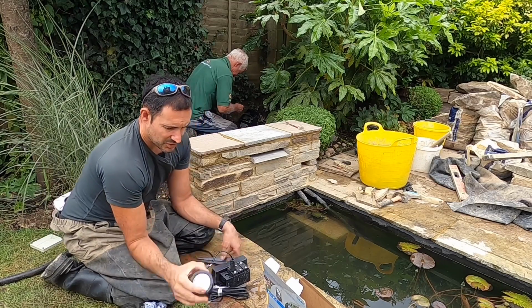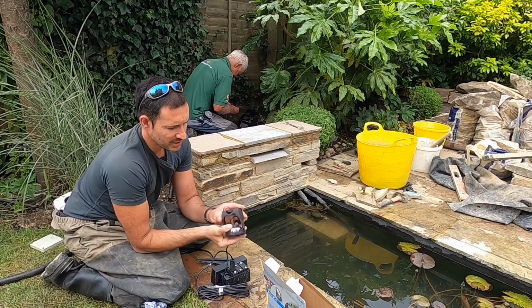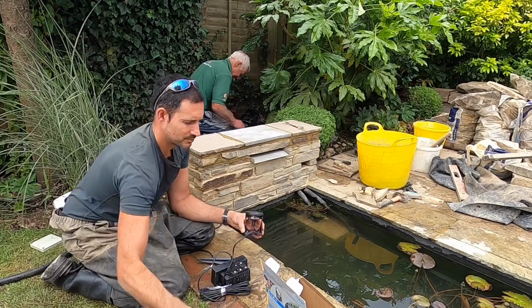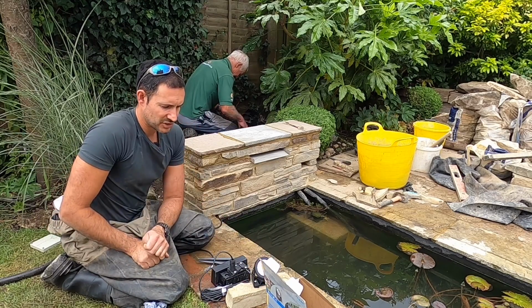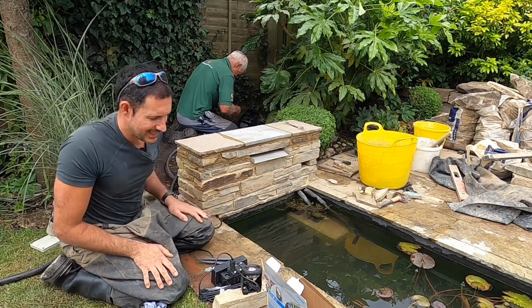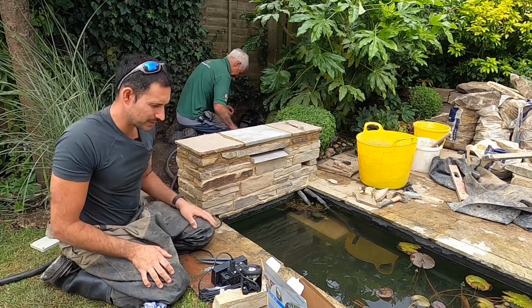But I think I'm going to remove, you've got a couple of stainless steel Allen screws on here as well at the base, and then you could actually screw that directly to something. So if I screw and rawl plug that to a heavy stone like that, which is going to act as a nice anchor, I can position that exactly where I want to, I can angle the light exactly how I want, and that will illuminate and uplight that quite nicely.